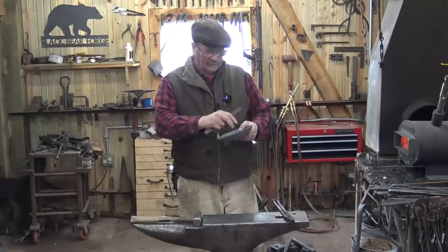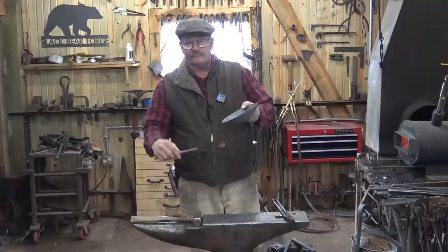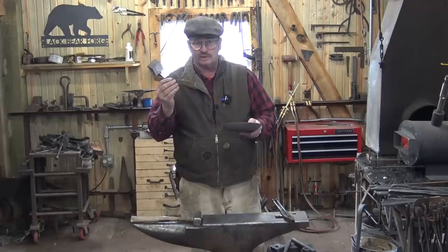And it's really important when you're making the handle to think about leverage. If you get a really long handle, which is nice to keep your hand away from the flame, it's going to have enough leverage that it might make the skillet tip. This being a heavier skillet pan that I use sometimes, it's going to be less likely to do that, so this handle shouldn't overbalance it, but it's something you need to keep in mind.